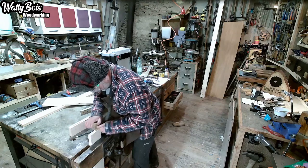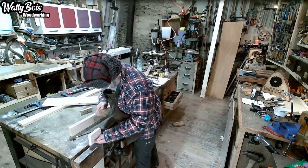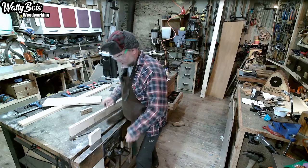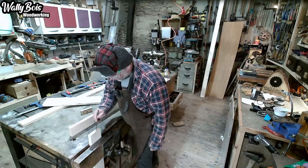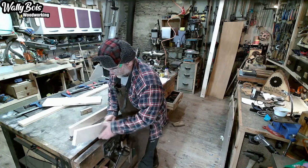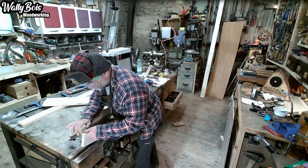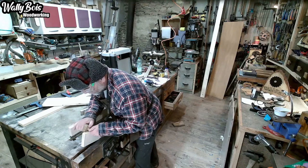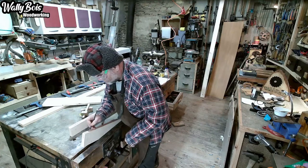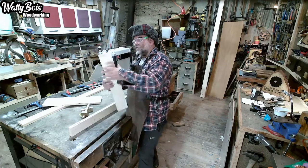And the beauty about using your... I've got to be right across there, because I'm going to have to cut that out as well. You can make it darker if you want, if you're going to see it easier. You can actually use that all the way around. And you do that so that when you come to using your handsaw, remember you always work from the same face. So when you're using your handsaw, you can see exactly that you're going down at 90 degrees.